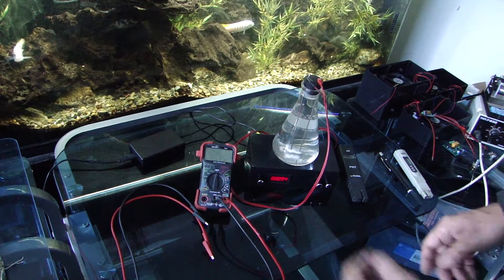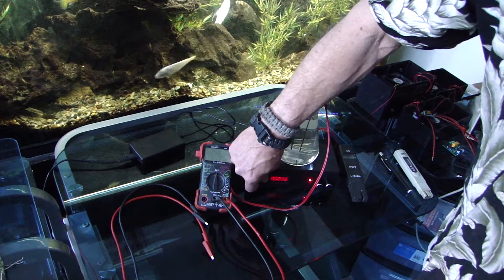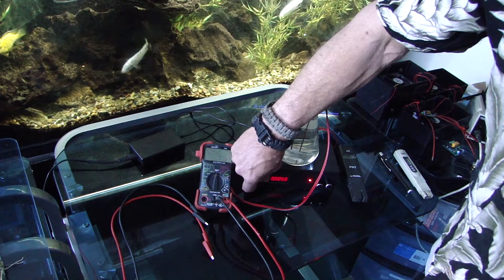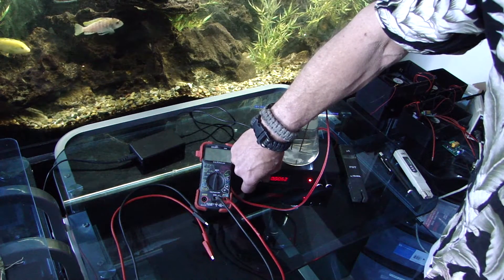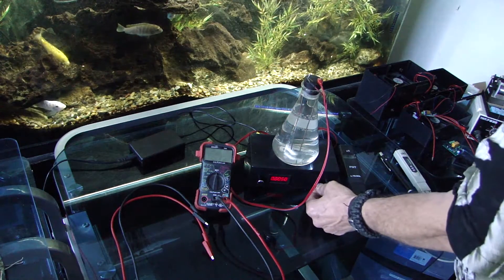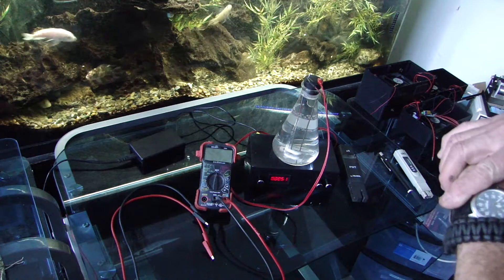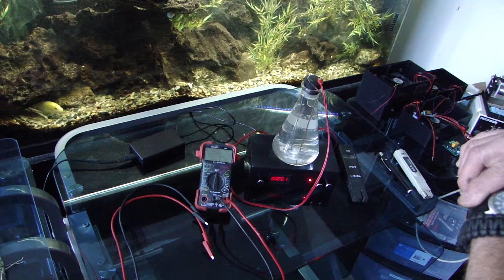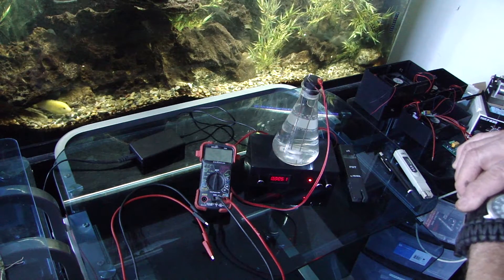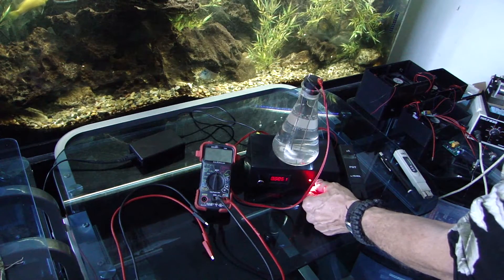Let's bring it back down to 5 amps. It's pretty sensitive toward the top end — you have to make real minuscule movements on the dial. So there's our 5.0 amps. We've got our reverse polarity set to about 10 seconds. Let's time it — we're counting about 16 seconds, which is a little too long. Let's decrease that.